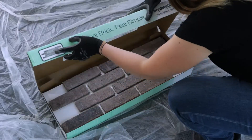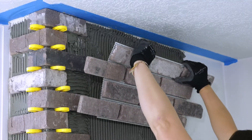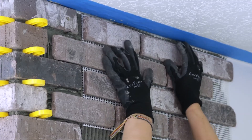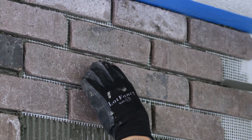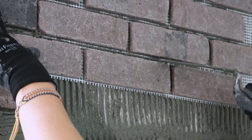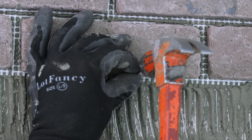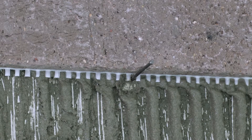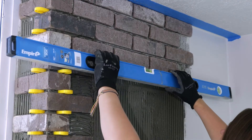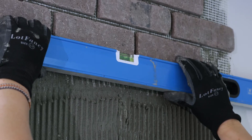When the corners are in place, start installing your brick web sheets — they should fit easily with the corners. We recommend running the trowel in between the bricks, allowing the mesh to push further into the adhesive. This allows your sheets to stick better to the surface. Again, place a finish nail if you see any sheets starting to slip or slide. Every so often, but especially on the beginning sheets, use a level to make sure you get straight lines.